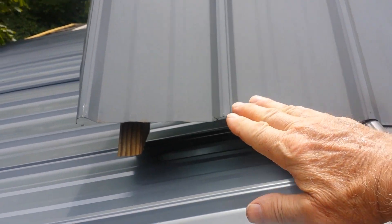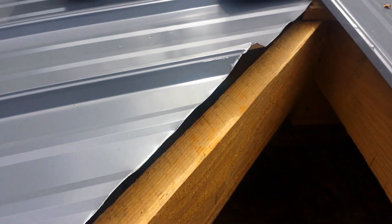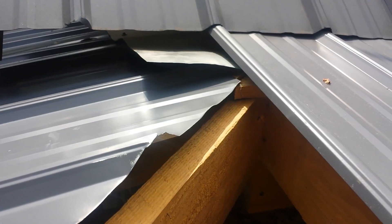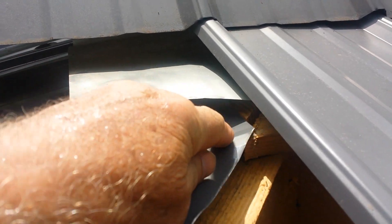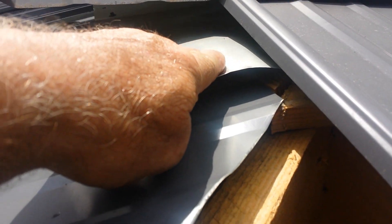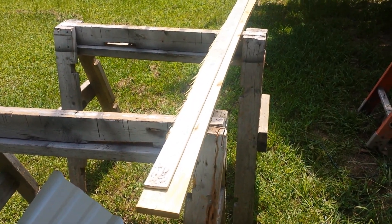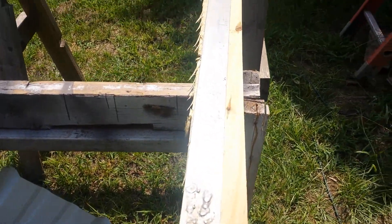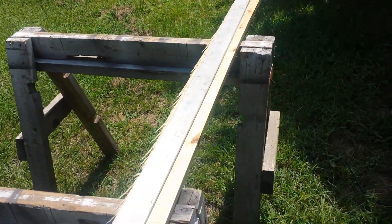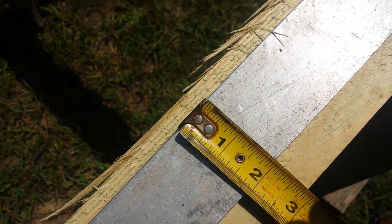This return on this roof here will come down over the top. I might have to bend some of these high pieces down to get them to lay down. One of the reasons I didn't make this tin any longer to go up underneath here is because I got the corrugation pushing against my drip edge, so I didn't want to go any further than I had to. I'm going to cut out my fillers — you can see how bad curved that one before is. I'll draw a line down through there and make sure it's three inches out here to the edge so I can get two pieces out of it.